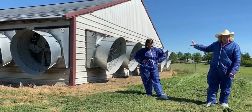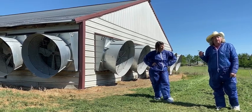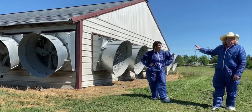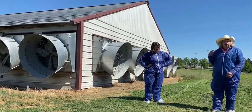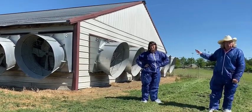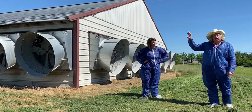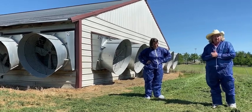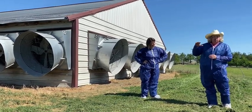When we've got all of these fans going, we may be pulling 0.05, 0.06, or 0.07 static pressure. You don't want the static pressure to be too high when all your fans are running. The higher the static pressure is, the harder those fans are having to work. You don't want to see 0.2, 0.25, or 0.3 static pressure — that means those fans are working really hard, and if pressure is that high, something is a little out of whack. Either you've got too many fans or not enough cool cell space, not enough opening for the fans to pull that air through. Monitor your static pressure, monitor the house temperature, and monitor humidity levels, because all of those things are important.